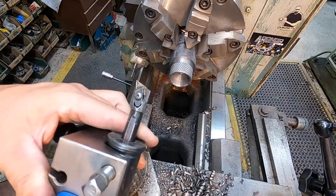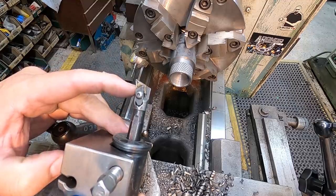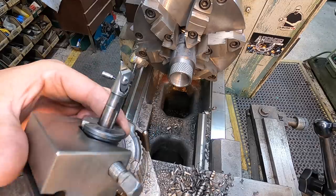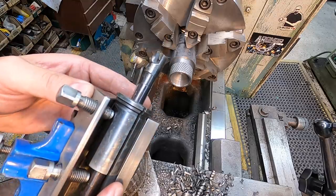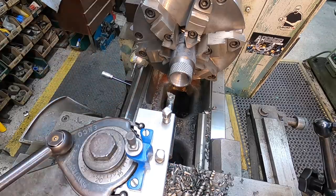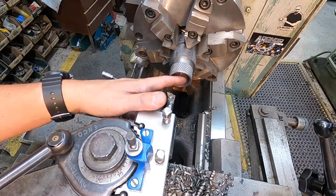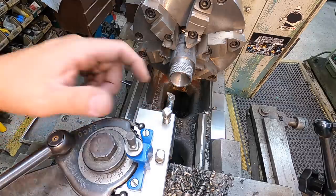This is an old carbide insert bar that we've had for years, and the way this thing is profiled, it actually works pretty good for getting in there and making a light undercut at the shoulder for something like this right there. So this is what I'm going to be doing. Just a half inch shank, got it mounted in one of those boring bar sleeves there, and that's what we're going to do, is just machine an undercut in that back corner there enough to relieve the thread where we can go in there with our threading bar and our tool, and then be able to feed from the inside out and not be cutting into material each time.